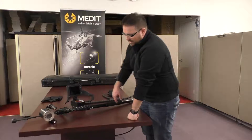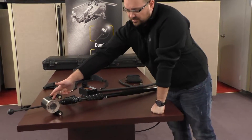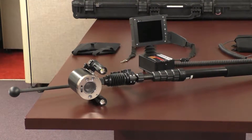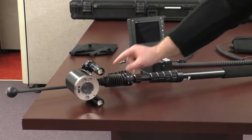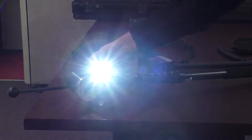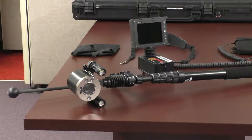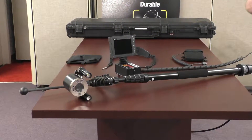Basically you're looking at a large camera head. It's got a 40x optical zoom and then 80x digital, or an additional 40x digital zoom so you can go up to 80x. Built-in LED lights for illumination. There are also these optional lights that you can attach on — they just clip on and they're extra high-powered LED lights for distance inspections. When you're trying to zoom in over 50 feet or more, that's what you're going to want to use to help illuminate that.